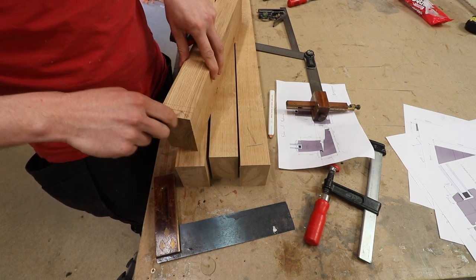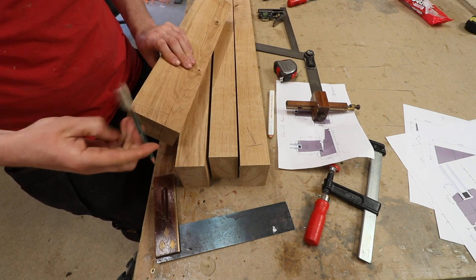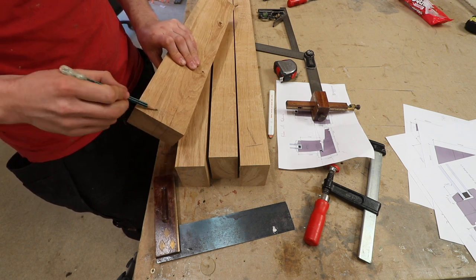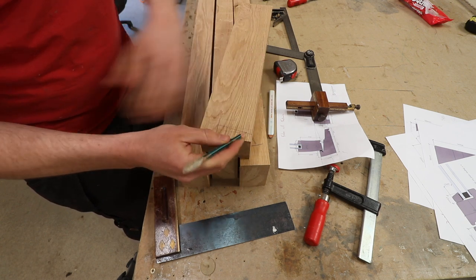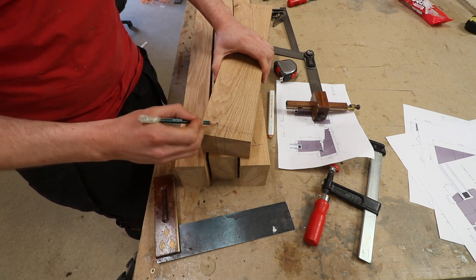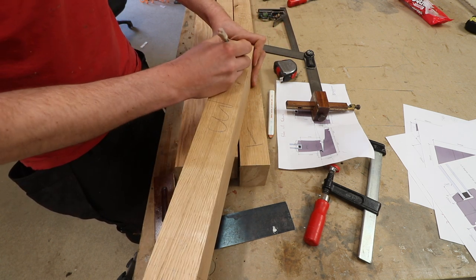If you're tenoning and got square blocks and doing this cut after, like I have to do, you have to set that tenon back square 10mm further back than the other one so that you can cut this bevel afterwards. But that's irrelevant for this project, so I probably shouldn't mention that. So that's our cut joint there for the sill. So sill, head.